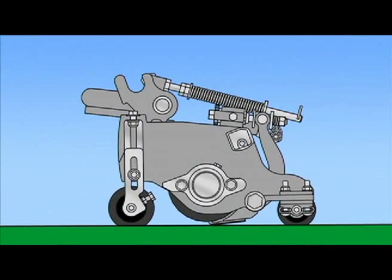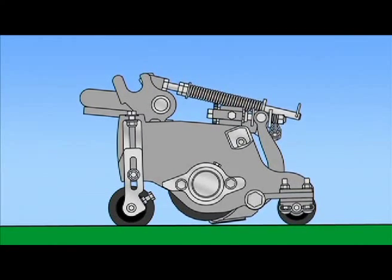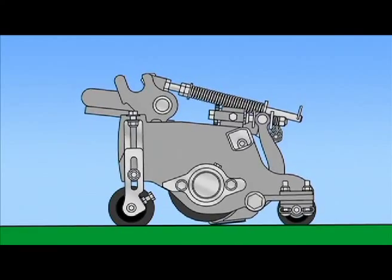One commonly used method is attaching the yoke to the front of the cutting unit and relying on a spring to the rear to maintain downward pressure on the rear roller. However, a front attaching point allows the rear of the cutting unit to move and the mechanical spring cannot maintain consistent downforce. The result? The cutting unit bounces at typical mowing speeds, resulting in an uneven cut.